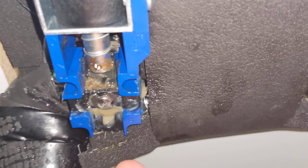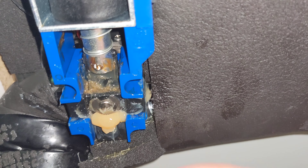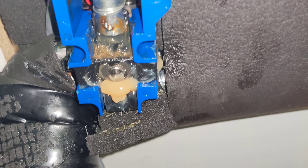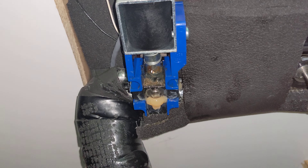And then when the valve opens and closes, it's going to be causing it to shove back and forth, getting lube underneath that linkage right there. And that is how you properly lubricate a bottoms-up valve.